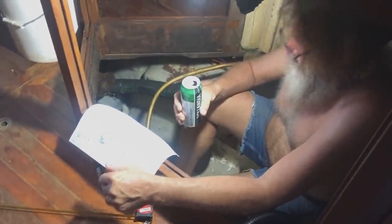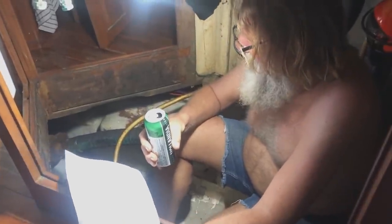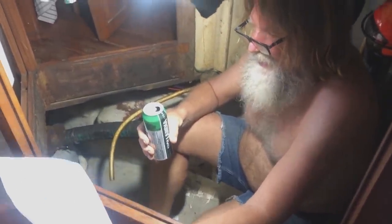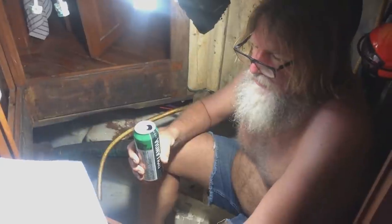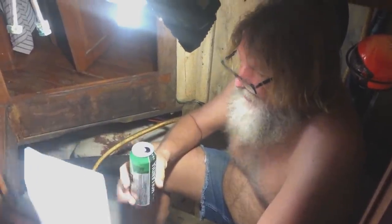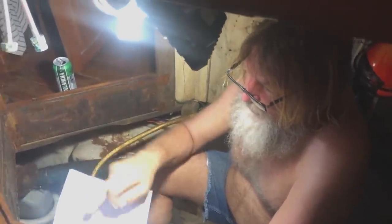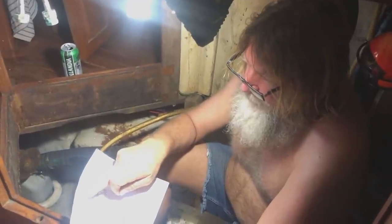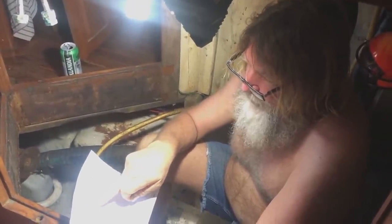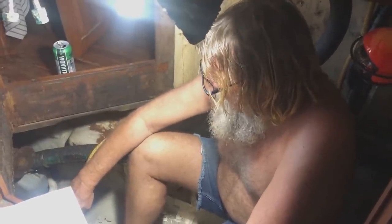I was just looking for Magnus, and I just found him. He's actually in the engine bay. What are you doing in there, babe? Well, I've got all the drawings for the Volvo engine and gearbox, including the engine mount positions. So I've just worked out the distance from the back of the flange of the gearbox to the rear mounting is 223.